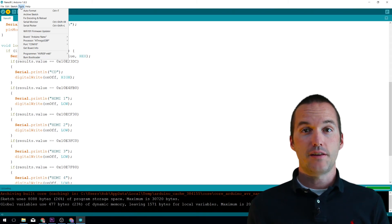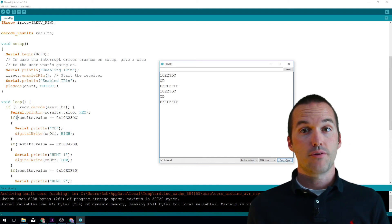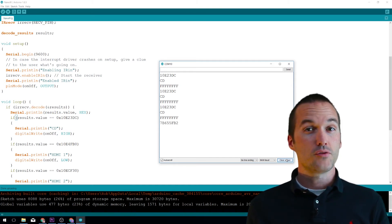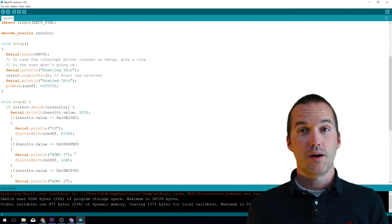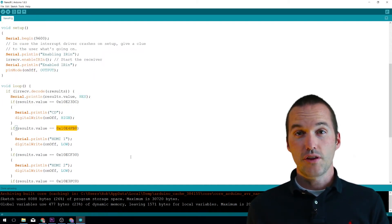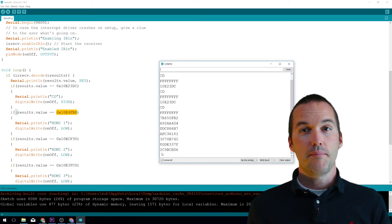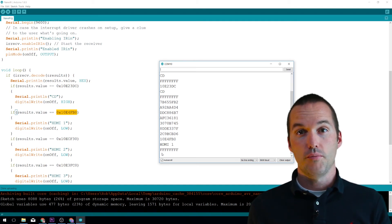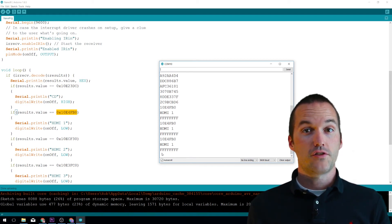Once we've got the sketch loaded, we can start figuring out which commands are being sent to the receiver. Open up your serial monitor and point your remote control at the IR receiver. Press each button for your receiver input control and take note of the IR code that's received. It's a good idea to check each button multiple times to make sure the code sent is the same every time and that you're not getting any interference. Copy the IR codes to the sketch replacing the ones from my example. It's not crucial that you update the serial print parts, but I'd recommend doing it because it'll make your life easier if you need to come back and update your components in your home theater.